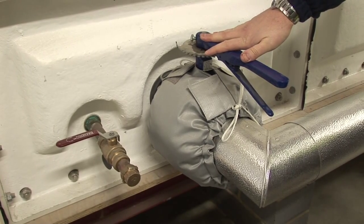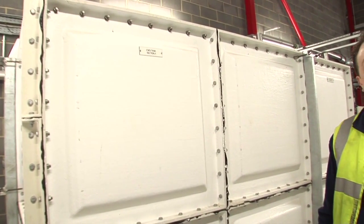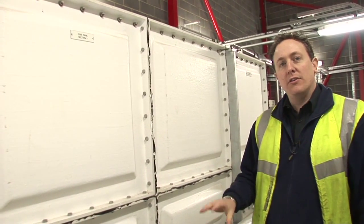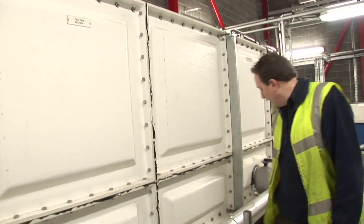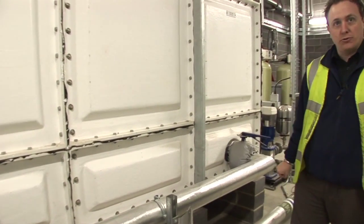Outlet from each tank, drain from each tank, and a ball valve to the rear for inlet. Overflows and warning pipes discharge externally to the service yard. If they're running, there's a label to direct you to the internal ball valves to check. Link together, common tank cold water out to the booster sets.